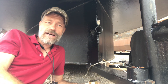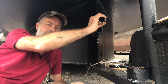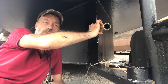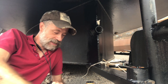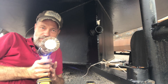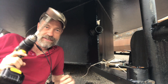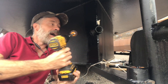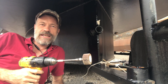That goes in there. Had I not chatted to Rachel, I would just have been taking this and whapping it in with a hammer, because it's about the right size but doesn't quite go in easily. However, Rachel told me that would be a very bad idea. What I need to do is use this flap drum sander, sized to be slightly bigger, along with Rachel's drill extension — and basically just clean out and slightly ream out the stern tube.